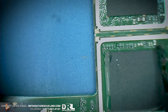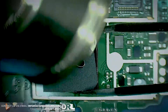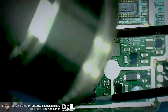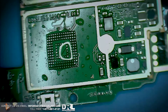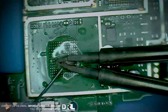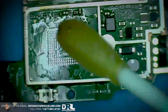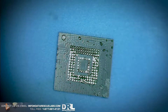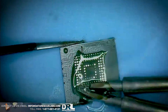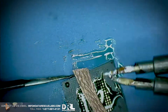We're going to start with some flux around the chip — this just makes the job a little bit easier. For this particular chip I'm going to start at around 350 degrees with low airflow. I just don't want to damage the chip. The chip is off. I'm going to clean the pads on the motherboard and put some solder on there. I wish all phones were this easy, because most of the phones I work on have tons of underfill and epoxy. Here's the chip removed — there are a few oxidized pads but that's not a big deal, I'll deal with them after once I get the data off.